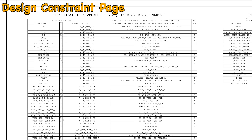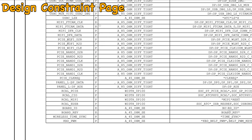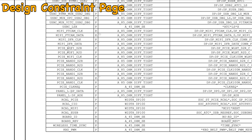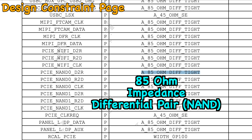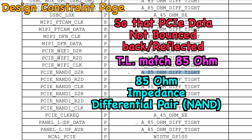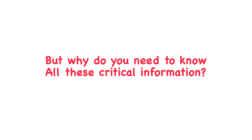The list can go on and on. Once you understand all of that, it's time to go to Apple schematics and find the design constraint page. You can see that Apple uses 85-ohm impedance to route the differential pairs. Your job is to design a transmission line to match this 85-ohm impedance so that the PCIe data is not bounced back or reflected.